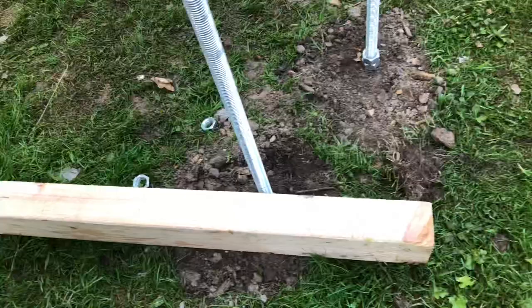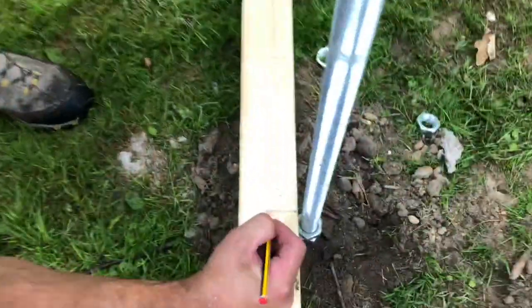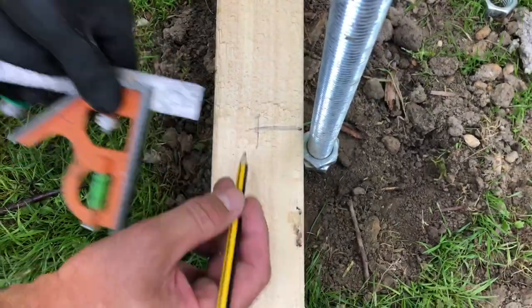What we do then is lay it next to the rods like that, as you can see. I'm going to transfer a center mark there, use a sliding square to find the center, and that's where we will drill our hole.